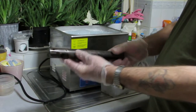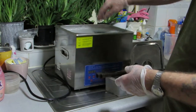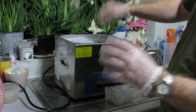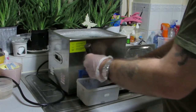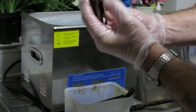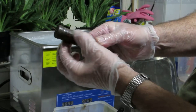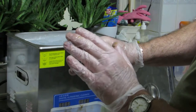We got a lot of grime off with the paraffin, but the trouble is now it stinks, so we've got to give it a good clean up. There's one other bit — that's the spring. Quite impressed with the quality of that, how it came up — you can see it's even shiny in places. So pleased with the condition of basically everything. But there is just one issue which I will show you before we put the cleaner on. We got the piston there, and you can see that's cleaned up quite well. We couldn't work out why there wasn't a washer on it. Once we cleaned it, I could see there's actually a little thread on the end of this, and there are vice marks on the side — so someone obviously had tried to get it out and broke it.